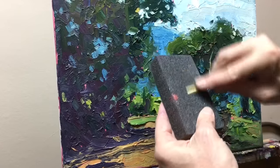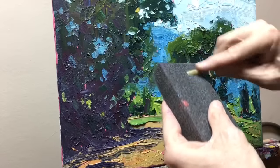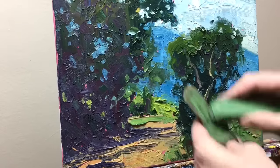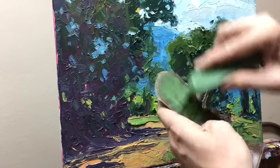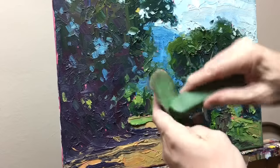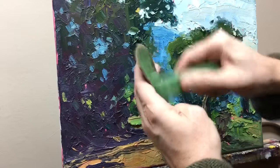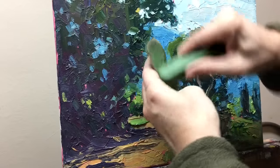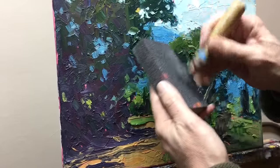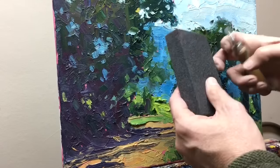Here I'm going to sharpen up the hole cutter using a 3M sanding pad — this is a coarse one, you can get these from most box stores. I've cut a piece of leather from the tongue of an old shoe and I'm rubbing a stropping medium onto it. You don't want leather that's too shiny, so use a piece with some texture, or sand off the shininess. I'm just sanding the metal here to sharpen it — you can use a stone as well.